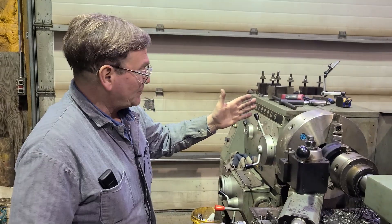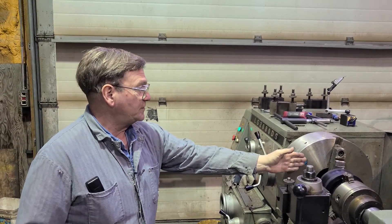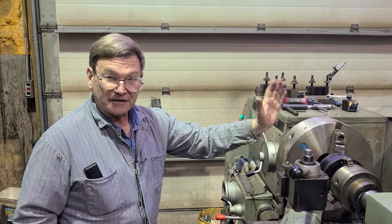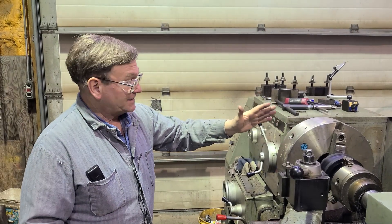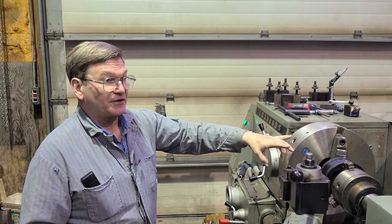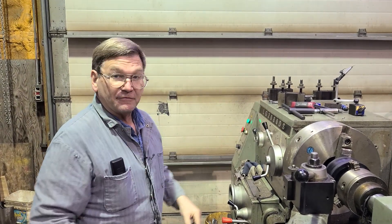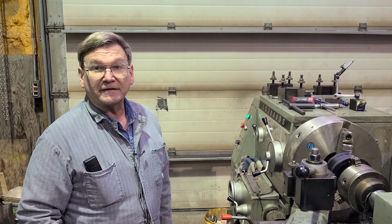One of the common things — say we have a sheet of rubber. What you would do is use a face plate, which could be a piece you put in the lathe chuck and faced off, but normally it's an aluminum plate. I'll often put a bolt and washer threaded into the middle of the plate to help hold the piece of rubber up there.